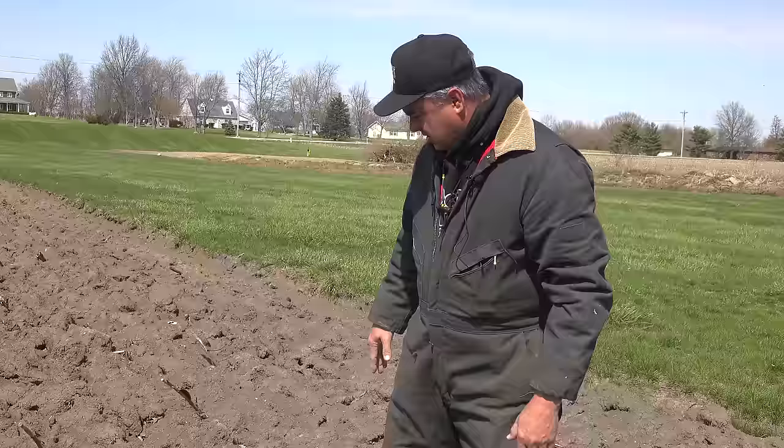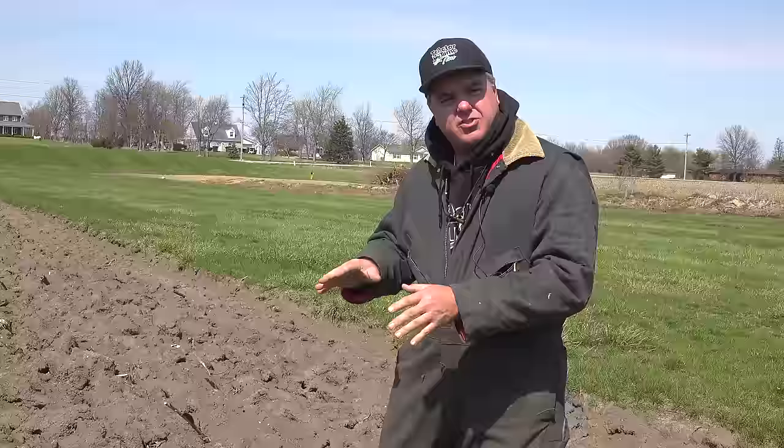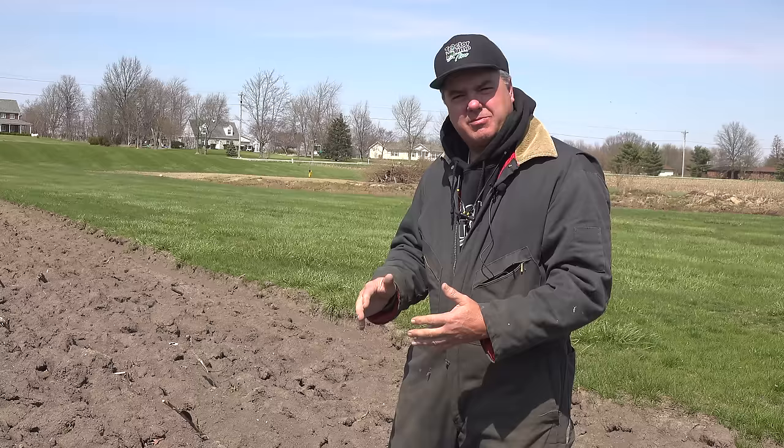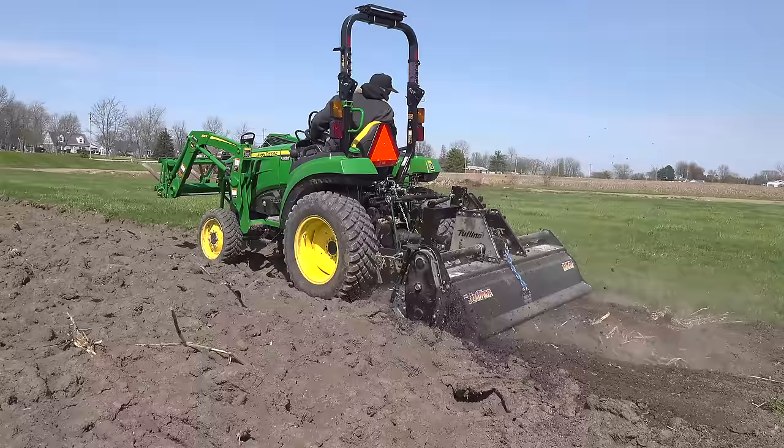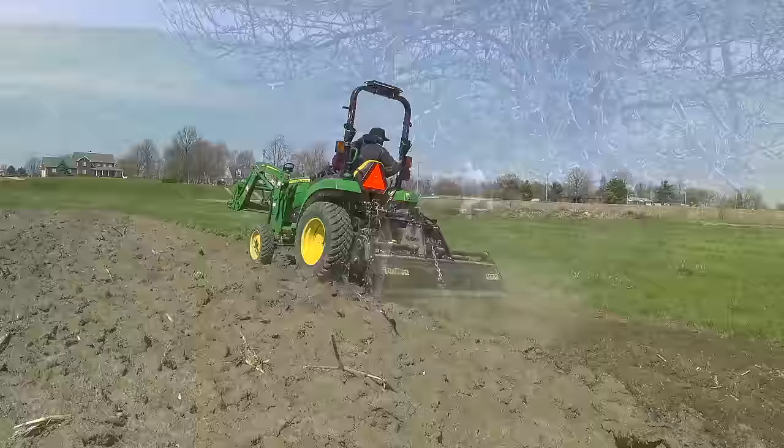I could get out and disk it first since it's been plowed, but what I'm going to try to do is till it — not too deep — because even though it's dry enough on top, this soil holds moisture right under the surface and it'll actually be pretty wet down there. So I'm going to try to till it shallow. That's going to be hard for me. Those skids on the end of the tiller aren't perfect at holding it up, so I'll have to use the three-point hitch to try to hold it up and just take a little bit of the surface.